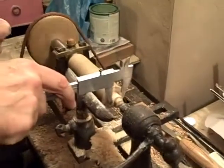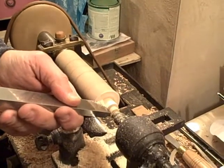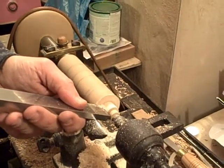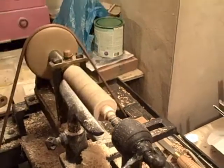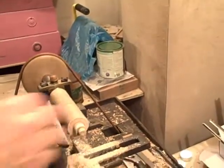Let's test this now — am I nearly there? I'm ever so nearly there, just a little bit more. One of the things that Joseph Moxon will tell you, of course, is to wait for the wheel to come round before you start pressing, for obvious reasons, because you'll break the woodwork. This one I've got here is a great big iron wheel. The one described in Moxon is actually a wooden wheel — a two-and-a-half-foot diameter wooden wheel — so I imagine most of the work on that one would be done by the foot against it rather than the inertia of a fast-spinning wheel.